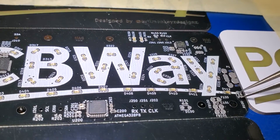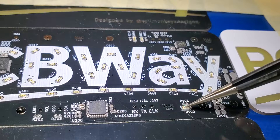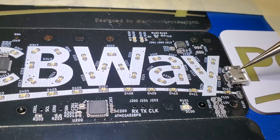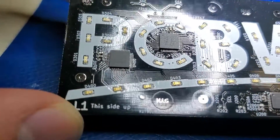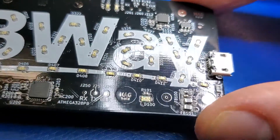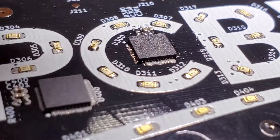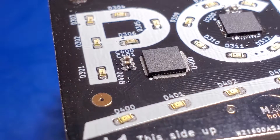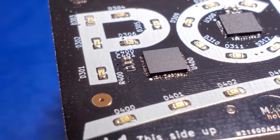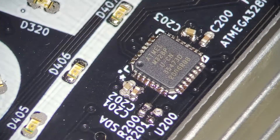There were just a few more parts to place, like resistors and capacitors, some miscellaneous LEDs, and the micro USB connector too. With every part in place, it's time to reflow the solder. I don't have a reflow oven, so I do all of my soldering by hand with a hot air rework station. The air on my station can go all the way up to 480°C, but for this I kept it to around 320°C. I start high and far away from the PCB and slowly move towards it in circular motions. I'm trying to avoid creating hot spots, and if I heat up the paste too quickly, parts can pop off from the flux evaporating all at once. When I see the parts start to reflow, I will keep the heat on them until I see the solder melt, and then I'll move onto the next part.